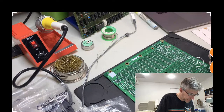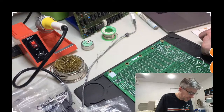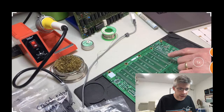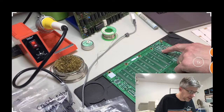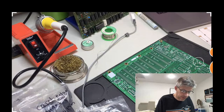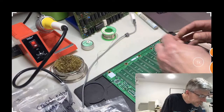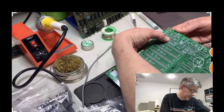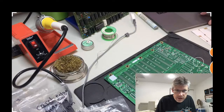The Apple board layout is pretty haphazard in the way Apple put the numbers on here, so that's an extra challenge — you just have to hunt around until you find the correct location. Here's R10, and right next to it is R30, and then next to that is R17. R15 is a 1 megaohm. R16 is another 12 kilohm, and I'm just putting these through, bending the leads over a little bit flat. R17 is also a 12 kilohm.